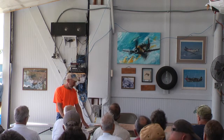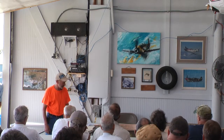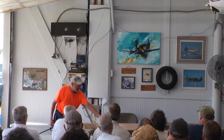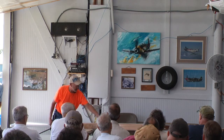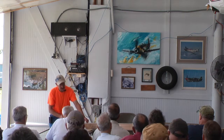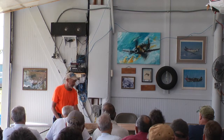So Jerry had a kind of a simple formula that he used to plot points on the block at this point. What he did is he established stations along the length of the blade. This would be station 0, then it would be 6 inches out, 12 inches, 18, etc. So every 6 inches he established a station.